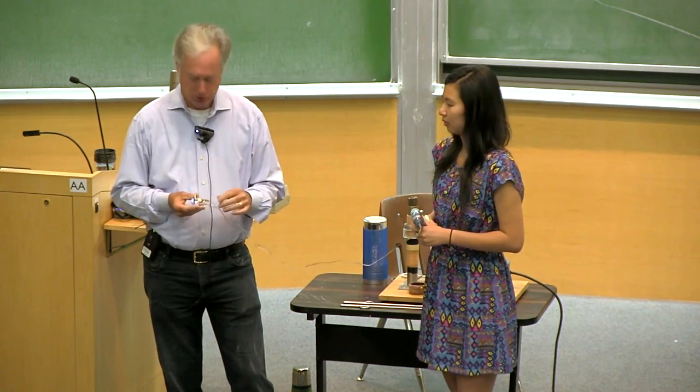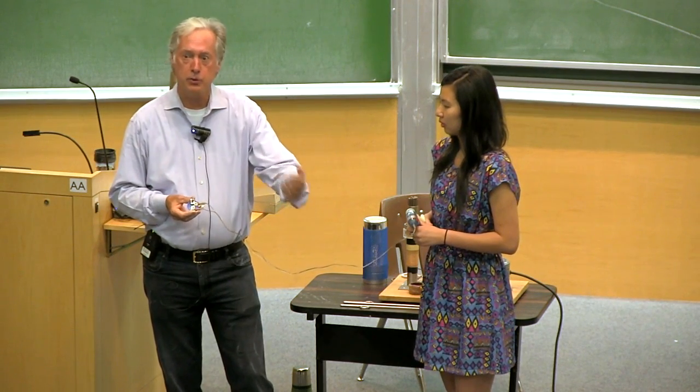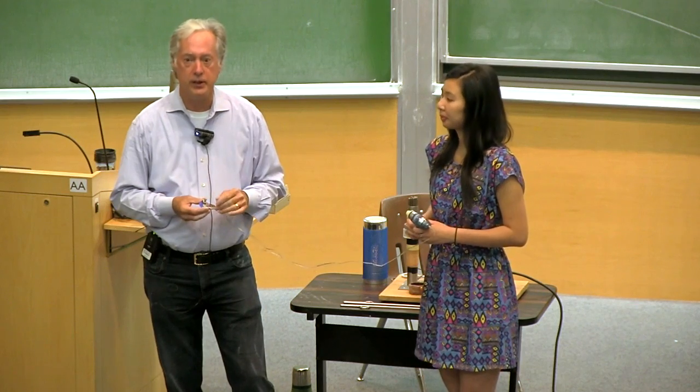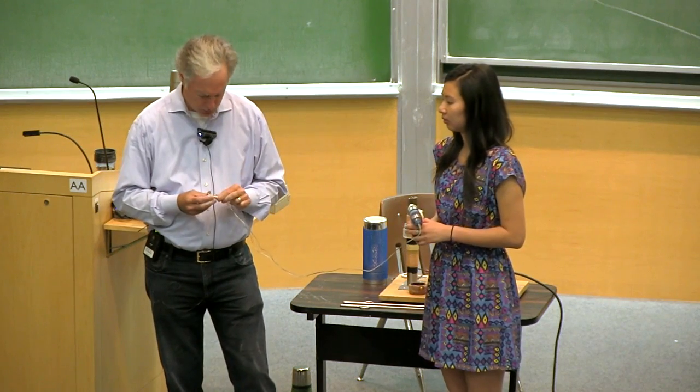Good. So it does it both ways. This flux equation, Faraday's law, as I'm going to write it in just a minute, allows us to make electricity from mechanical energy or to do mechanical work from electricity. Motors and generators are the same thing in essence, just working in opposite ways. Was that exciting? Yes, it is.